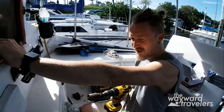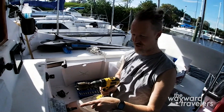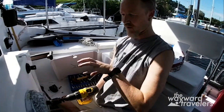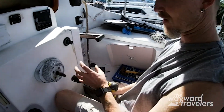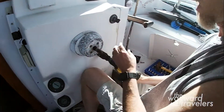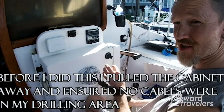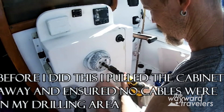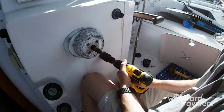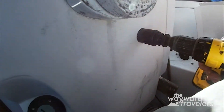I've located, as best I could, the center of the steering pedestal to where the body of the motor will go in. I'm drilling a slightly smaller hole here because I want to be able to fudge it just a little bit, and I can do that by using two of these hole saws. Let me make sure I'm going to clear it out back here.